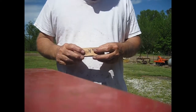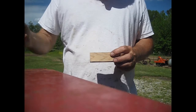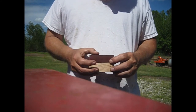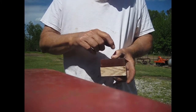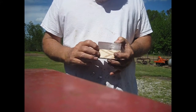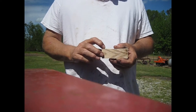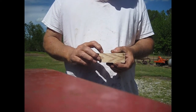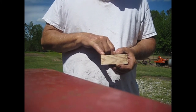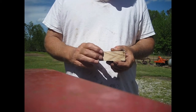Okay, lining up the hole for the block that we have, that's a 1 1/4 inch. I took the old block, put it on top best I could, centered it, put it in a clamp, and then drilled a 1/4 inch hole through here. Actually, I just marked it, drilling through here, didn't go very deep. Then I took this over to the drill press, used a slightly bigger drill bit to drill out the hole, since it's supposed to be a 1/4 inch, but I think it was a 17/64 that I drilled through here, just a little bit bigger so the bolt would slide.